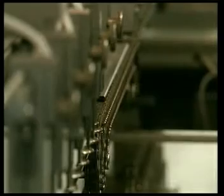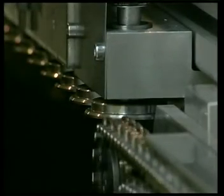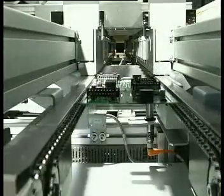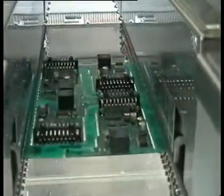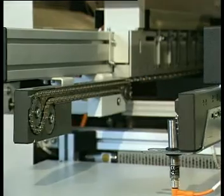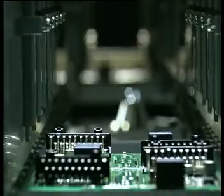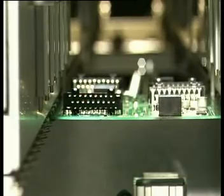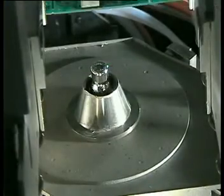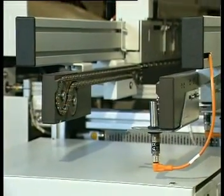Flexibility of the conveyor system is a major issue for mixed technology assemblies. For this reason, the conveyor system is available in two variations. One variation is a pallet conveyor system for boards mounted in solder pallets. Also available is a segmented roller conveyor for the conveying of bare circuit boards. Integrated into the conveyor system are mechanical clamping devices to position and hold the assemblies during the fluxing and soldering process. The segmented roller conveyor is equipped with a motorized width adjustment and can optionally be specified to operate under closed-loop computer control.